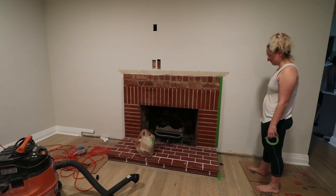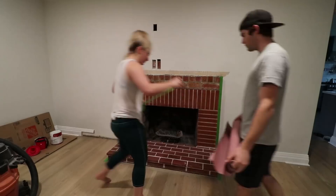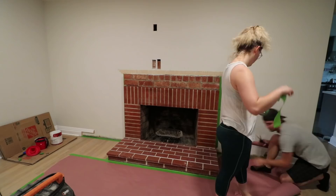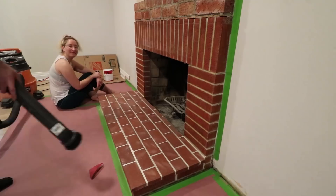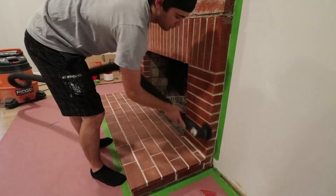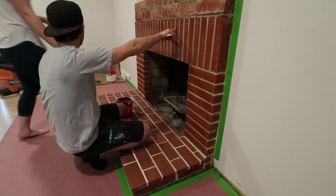The first thing we wanted to do was whitewash the fireplace. This could be a bit messy, and it would be much easier to do before doing any of the building. We started by taping around the fireplace and laying down paper to protect the floor. Next, we used some sandpaper on the brick to eliminate any rough spots. This also helped clean the brick because over the years it had gotten some spots and stains. I didn't want to risk those showing through the whitewash, so we did a very thorough vacuuming and cleaning before putting on any paint.